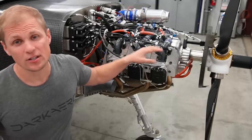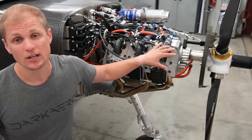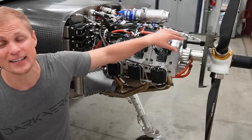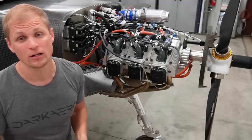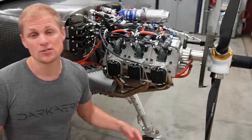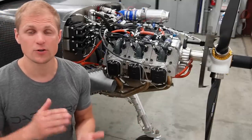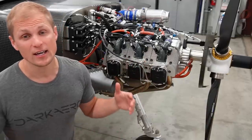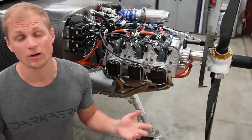Once we picked the engine, there were a couple ways we built the airplane specifically for it. The cowling fits the engine pretty tightly, and we built a pretty minimalistic engine mount and firewall. We also tied some of the nose landing gear structure into the engine mount to integrate structures and eliminate additional hard points. The basic principle is: if you're trying to reduce weight, you want to consolidate everything into tighter packages, integrate structures and systems where possible, and completely eliminate hardware if you can.